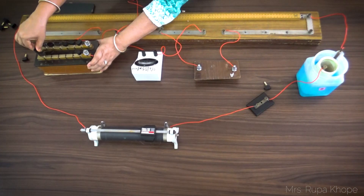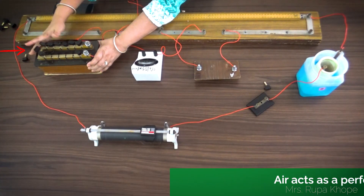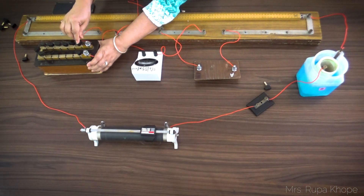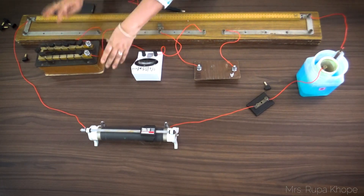You can see the key here. This key, when you take it out, is an infinity key — there is an air gap inside. So when you remove it, the resistance is infinite. Whereas when you put this key in, all the knobs should be made tight. This is the most important precaution you have to take; otherwise we will get wrong readings. So this is the resistance box.